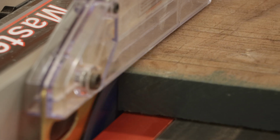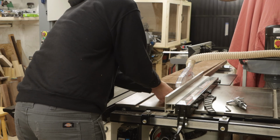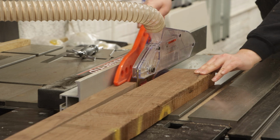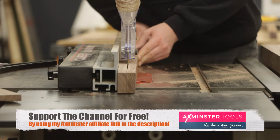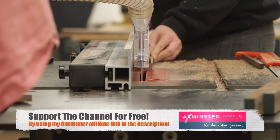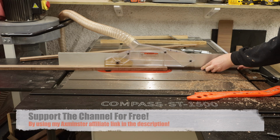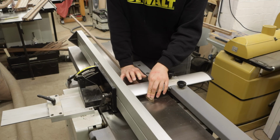Now, there are wrong and right ways of using a vacuum bag press. Some methods give you more even clamping pressure, and some other ways can damage the bag and not even completely flatten the veneer. One thing you'll always see me doing is adding a scrap board on the top and bottom of the piece being veneered. This helps the veneer completely flatten onto the substrate. If you just let the bag do that, there's a chance where there's wrinkles in the bag, the veneer will bubble up.